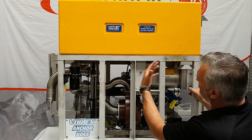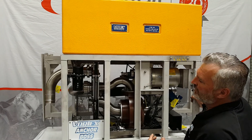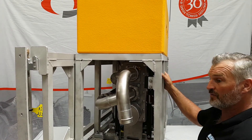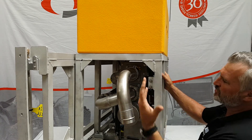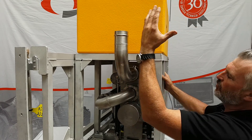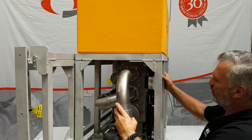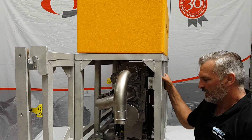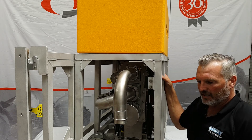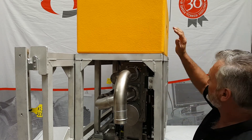One of the things we found — obviously the control can gives all the data, and how we're doing the water flow was a bit of a secret, but we've done loads and loads of backup testing and are very happy with the accuracy. What we found on previous jobs is that because it puts out so much water, the discharge will act like a jet that starts to throw the ROV around. So we incorporate this — again, feedback from the ROV crew — so they can direct the jet of water coming out of the tool to wherever they want, to stop the ROV getting thrown around. You can move the jet up, backwards, down, whatever you like.